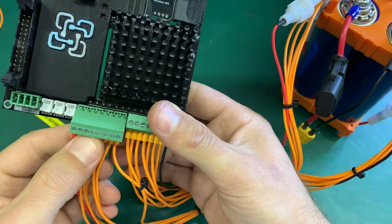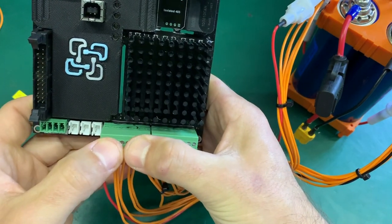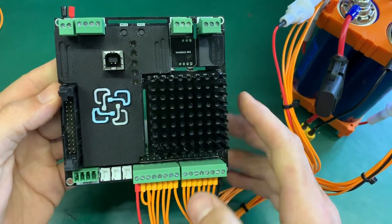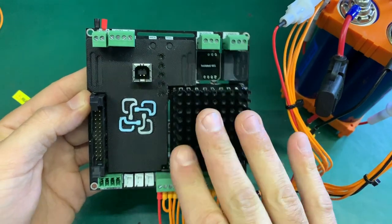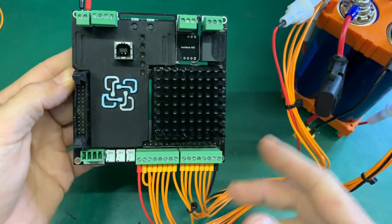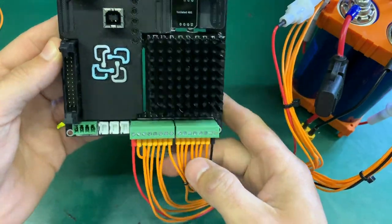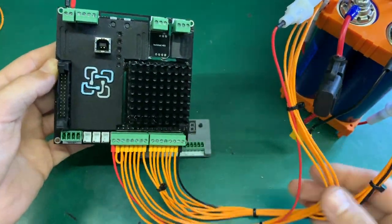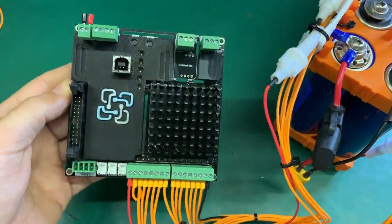Pay attention when connecting — match carefully and connect properly. Now you have to plug in a USB and start configuring the software, telling it how many series cells you have. That finishes the balancing wiring and fusing to your WatchMon 5 — which is very, very important.